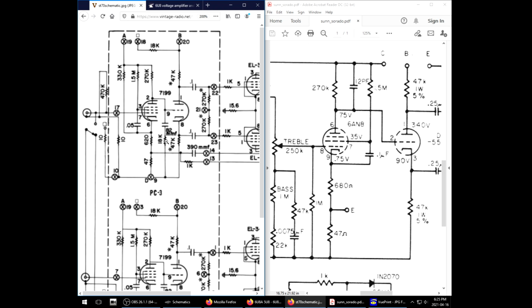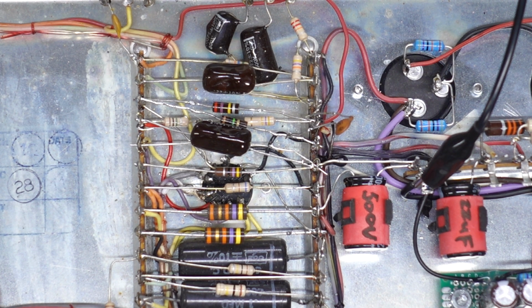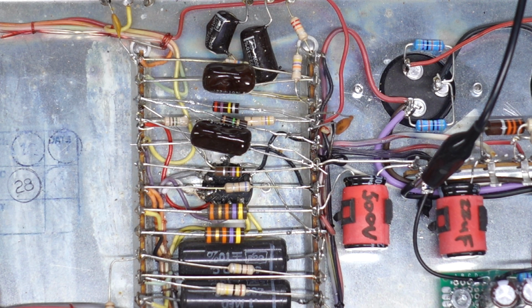And sure enough, if I play it now, so yeah, I think it was just a case of excessive grid current, and Valve Wizard said you might need a big grid stopper, and sure enough, 1 meg. It's a huge improvement. 50% volume, gotta bring down the mic. Much cleaner, much cleaner.